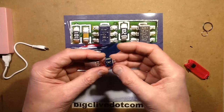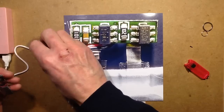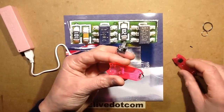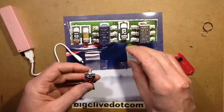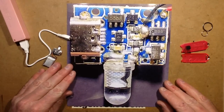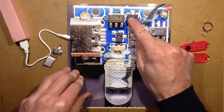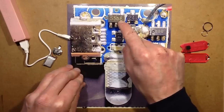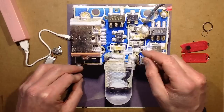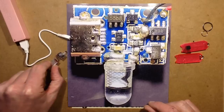The circuit board itself has a little button on one side. It's got the charging port, which is quite well soldered — the pins are properly soldered through, so it shouldn't do that thing where you push the lead in and the port just pops in. It should be quite good that way. It's heat-staked onto two pins. The circuit board inside is actually fairly complicated. It's got the charging connector, a charge regulation chip, and I think this transistor — marked 55B8 — is tied in with it. I found it referenced on a Chinese site but couldn't find the actual data. That controls the charge current to the battery; I think it's about 150 milliamps.